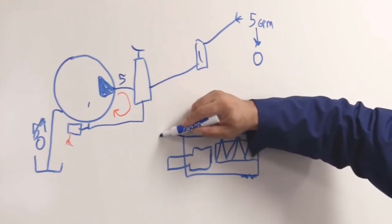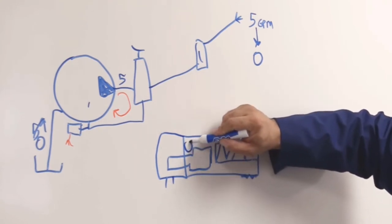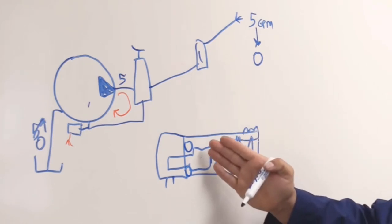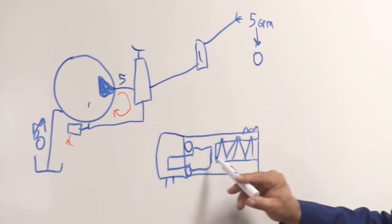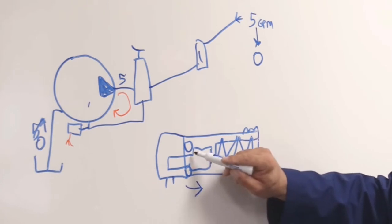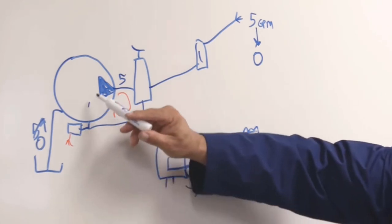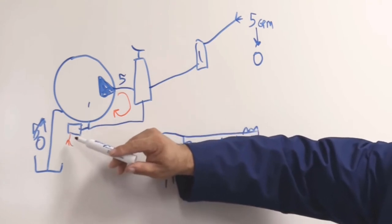Then we add a cap on here with the discharge port. And then there's an O-ring seal here so that when it has cold water applied to it, the thermal valve is closed off and there's no water leakage. But as soon as it gets up to temperature, this pill will move in this direction and come off the O-ring seat and allow water to come out the discharge. So while this water is circling around, all of a sudden this opens, boom, it comes right out, evacuates.